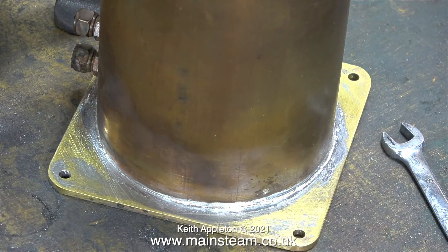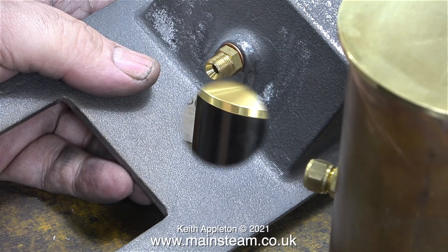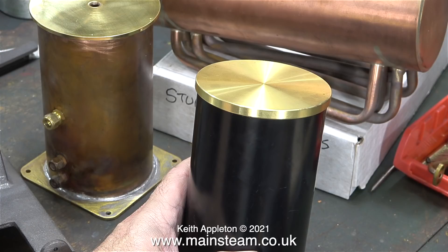Time for a bit of an interlude. This is the base of the condenser, and I wasn't happy with the soldering so I reheated it and cleaned it up using a small paintbrush dipped in water. This clip shows the exhaust outlet on the condenser on the right-hand side, and the steam union fitted into position underneath the chimney. When I fit everything together I will be using a PM Research cast elbow and some PM Research threaded tubing. In the last episode I put the cap from the water tank into some cellulose thinners — all of the paint quickly fell off this piece of brass, and now it looks very nice indeed.